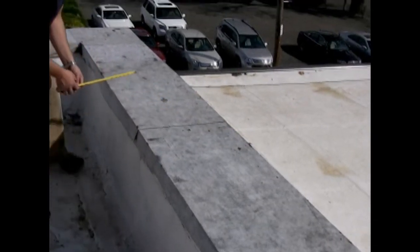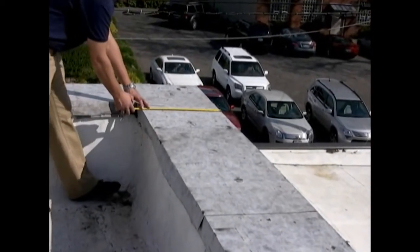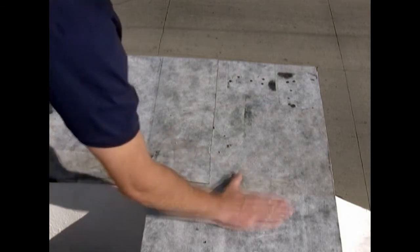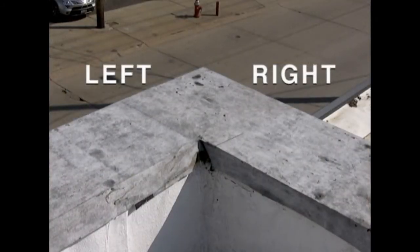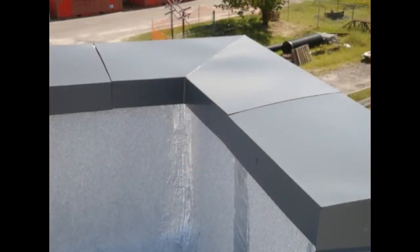Let's start with a brief review of how a coping is sized up. Measure wall width every two to three feet along the entire wall length to establish minimum and maximum wall widths. When filling out an order form, right and left hand notations may need to be made. Left and right hand notations are taken from the roof area, not the ground, as coping is installed from the roof edge. In combination with varying wall widths, these unique conditions can easily be addressed with welded transitional miters.